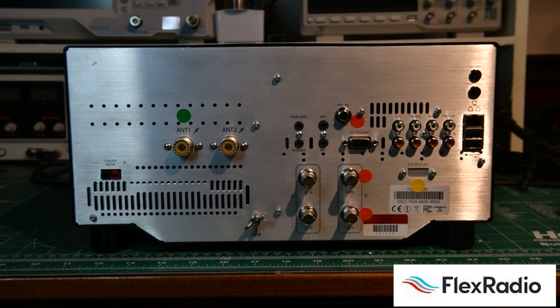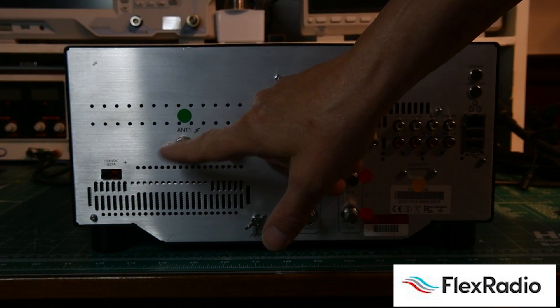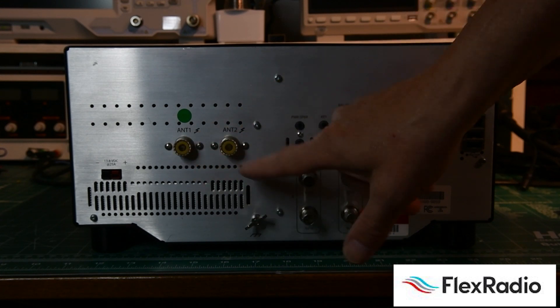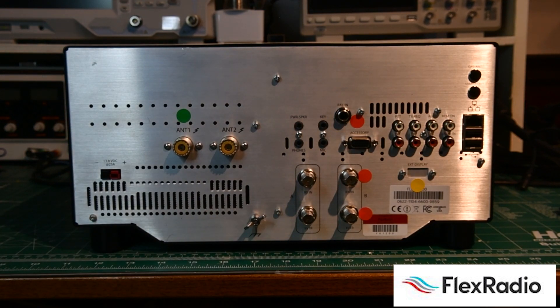The 6600 is like having simply two 6400s on your bench, sharing a lot of resources. Instead of having an antenna switch, you now have two spectral capture units. So you could hook one antenna up to, say, your 80-40 dipole, and hook the other antenna directly to your tribander and use both at the same time — or a 6-meter antenna — so that you could be on an 80-meter net and on 6 meters at the same time, listening with the proper antenna for the proper band.